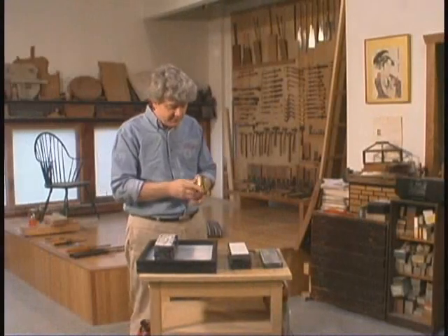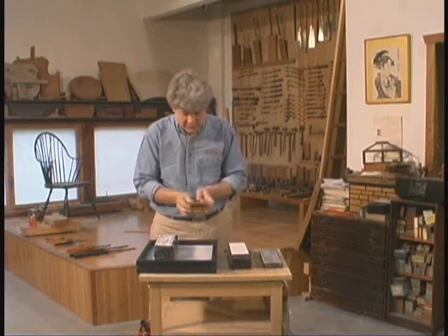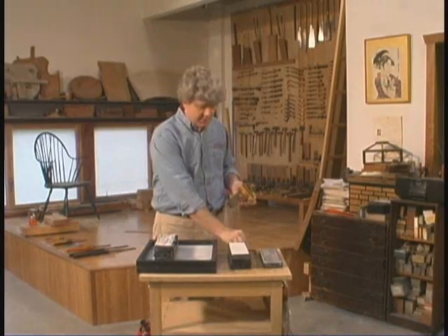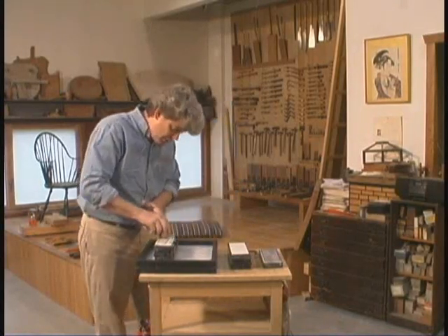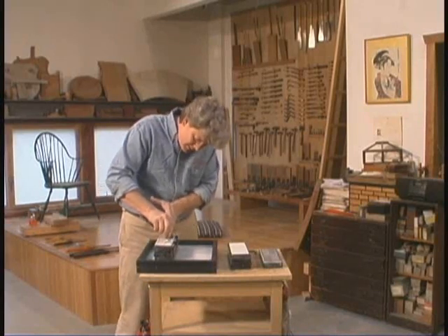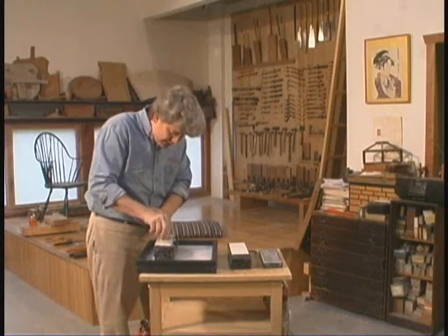If you need to make an adjustment, just loosen it a hair, just a little bit. You can pull the blade back or push it forward, whichever you think it needs. Tighten it right back up and you're skating. You can put an arc in the blade just by skating in circles and working the corners. Or you can go just as straight as you want, and the cool thing is you can work out over the corners and edges of the stones like I like to do freehand.